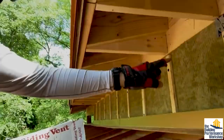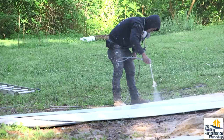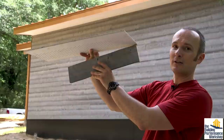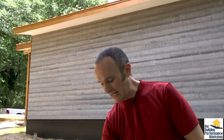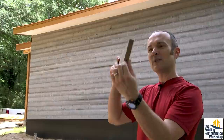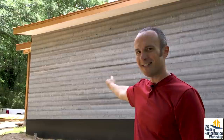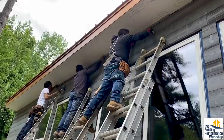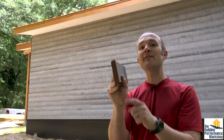What we did: we had the rain screen running from the bottom to the top of this wall with a bug vent — the Cor-a-Vent — at the bottom and the top. Then we had them install that cement board soffit paneling that you see pre-painted and nail that up. Then we had them put the siding up so that it butts into the bottom of that. This detail was kind of difficult because we've got a tongue that you need to sit into a groove, and in order to get the groove up over the tongue you need a quarter inch of upward space. But you can see there is not a quarter-inch gap there — because they carved off the back of the top piece so it didn't have to go up and over. They were able to get it completely flush along the entirety of these walls, which was an unexpected creative fix.